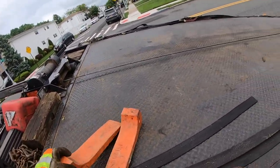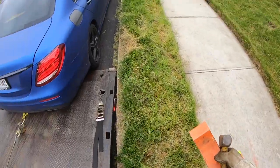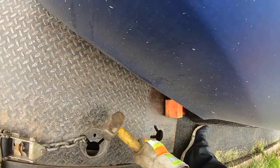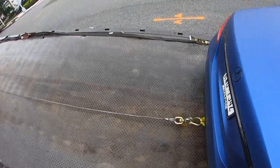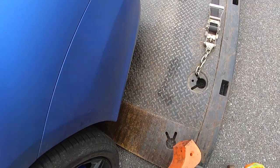So, this car is gonna have all the wheels locked. So, we're gonna skate it. Right now, we're gonna use the orange skates in the back, because these suck. I don't like these orange ones. You see the markings? They grip on the ground too much. They're kind of soft. The green Wreckmaster ones are great because the plastic is super hard compared to this.